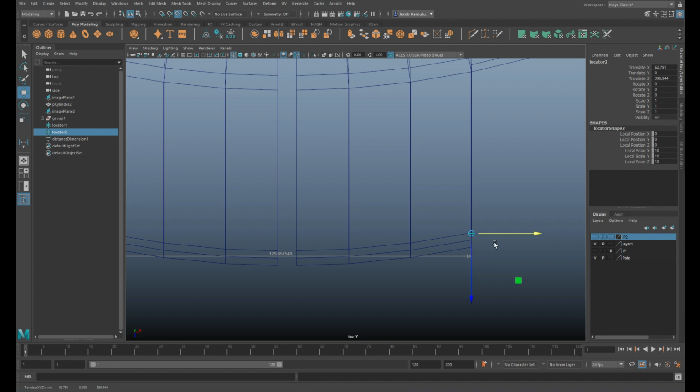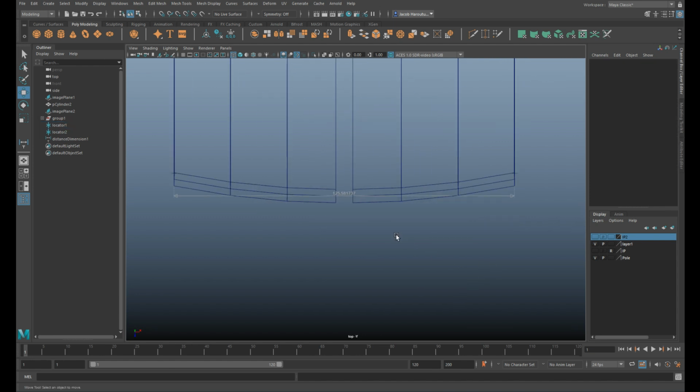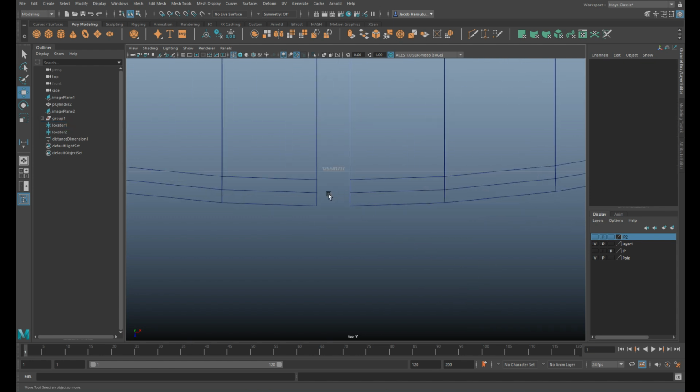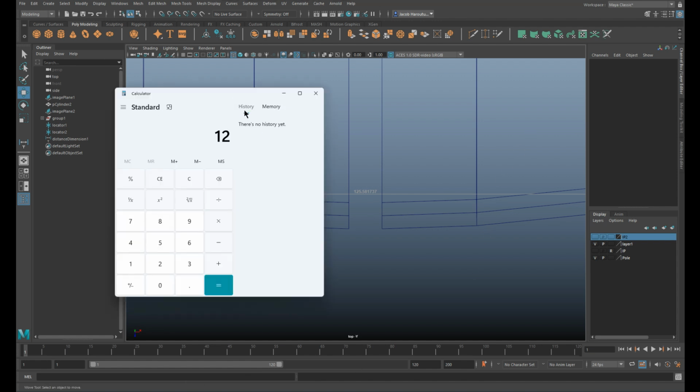All right, so we have 125 millimeters, but that's really not the case. We just have to multiply or divide by 10. So we got 125.5 millimeters divided by 10. It's 12.55 millimeters. Let me see if I have a screw that is that long. I have one that's 20. So we'll go ahead with the 20 millimeter one. The screw will probably stick out a little bit, but that's all right.